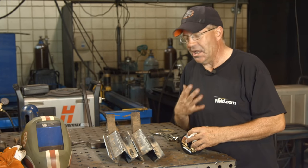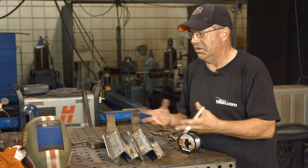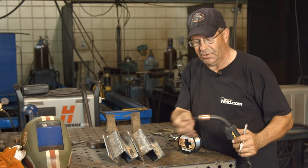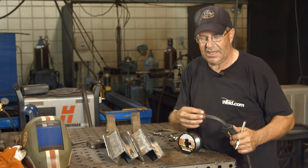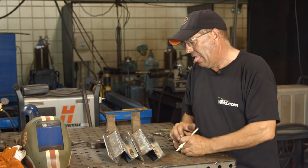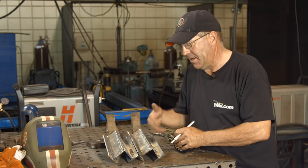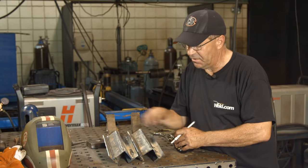To review: I can't answer why the wire wasn't coming out nice and smooth, because I went through all the tensioning and my gun was nice and straight. I had a good clean contact tip in. If somebody asks why I'm running this with a nozzle when it's gasless flux core — it's because that's the only way this contact tip will stay attached to the gun. You're getting the same results either way, and interestingly, the one that didn't feed as well actually looks better in the final weld.